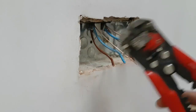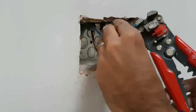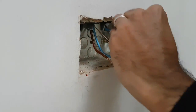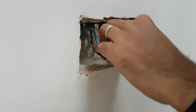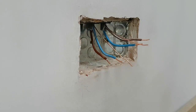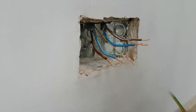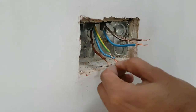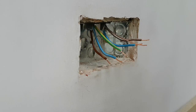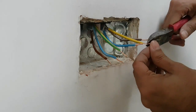We'll use a wire stripper — it makes it a lot easier to strip the wires down. Simply put it in and job done. Take about 10mm off — that's a reasonable size. Do this one as well, and then the last one. Then I'll put the sleeve on, so I grab some earth sleeve and just measure it up. That's it and that's ready to go — just going to shorten these slightly and then position them for the new socket.